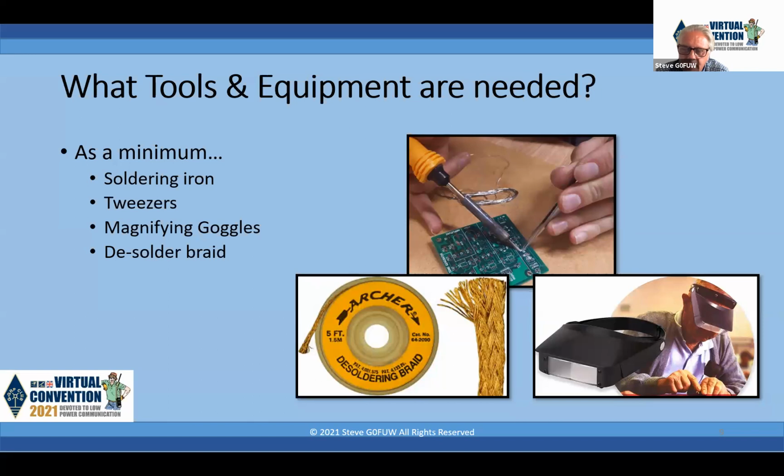You don't. The best way to do it is you tin the pad. You know, put a decent amount of solder on the pad where you're going to put the component. Hold it in place as per the picture, and then melt the solder so it attaches that one end very well. And then you can spin the board round or move your position, and then just solder the other one with the soldering iron and the wire. So you're not trying to do three things at once.